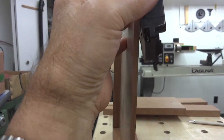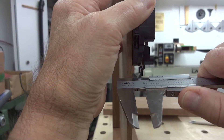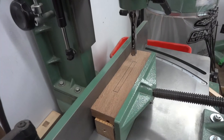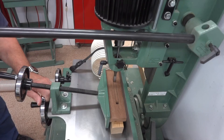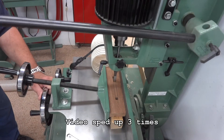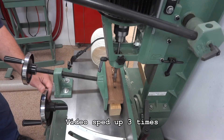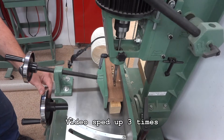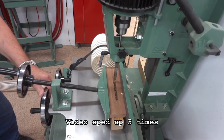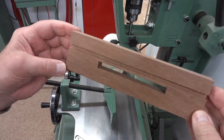I need to determine here where the pendulum rod is going to pass through the middle sill — I don't want that slot to be any wider than it has to be. This is a hollow chisel mortiser. It does a great job making square holes, and this is where I need a square hole. What I usually do is the extreme outside plunges first, then go along and miss a little bit — usually a little bit less than the width of the chisel — and then afterwards plunge through and nibble out the rest. Works really good. And there we are, a nice, neat, perfectly square slot.